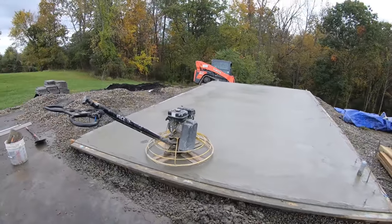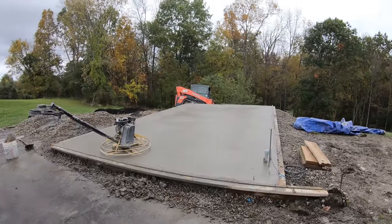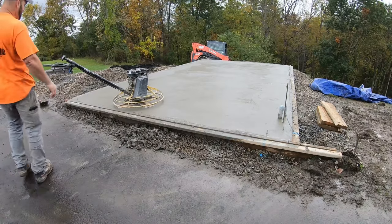All right, got the blades dead flat. Not using the pan on this because it's too small, and the floor is actually super flat. Both floated, then Fresno'd it. Got the blades flat. Just gonna run the slurry out. We got threatening skies the whole time.